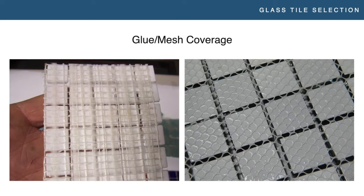The tile on the left has the back 100% covered with glue and mesh — that is a product I would be scared of. If that glue is water soluble, what you're bonding to with your thinset is that glue. Once that glue starts to melt, your tile is going to start falling off the wall. The tile on the right is one we used to import. When we first started importing it, the entire back was covered with glue and it failed miserably in submerged testing. We went to the manufacturer and asked them to change how they apply the glue — just put it on the mesh and press it down. You can see dull spots where there's no glue and shiny spots where there is glue, but you're actually getting a good percentage of coverage and bond at the back of the tile. We tested it, it did very well, and we sold it in pools for a number of years with no issues with delamination.